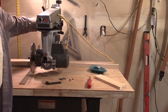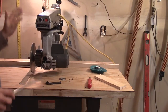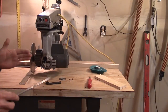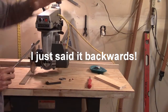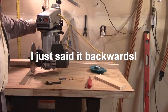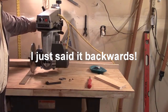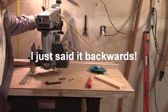One on the front, one on the back. If you just loosen one a little tiny bit and adjust, and tighten the other one just a little tiny bit — so if the arm needed to swing to the right, you would loosen the front screw just a little bit and tighten the back screw by the same amount.